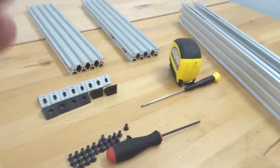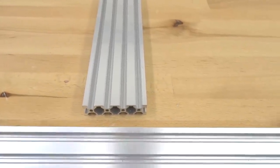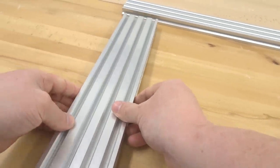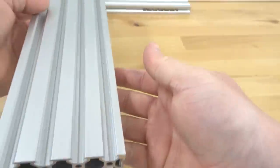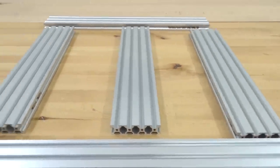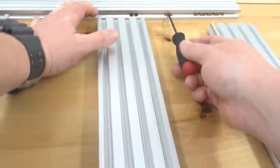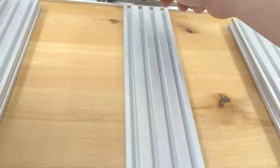Let's go ahead and grab our 20 by 60 rails and place them in the pattern that we're going to build with. Lay this piece horizontally with the T-nuts facing the 20 by 80 rail, and the same with the opposite piece. Place the left-side piece in front with the T-nuts facing the 20 by 80 rail. Take the middle piece — since we have two T-nuts on each side — place it in the middle, and then our last piece for the right side with three on the right slot. Go ahead and grab your ball driver and we're going to manipulate our T-nuts into place. Each one is going to receive two T-nuts, so on each end of the 20 by 80 rail, push a T-nut right to the corner.